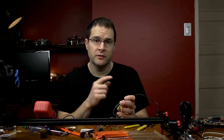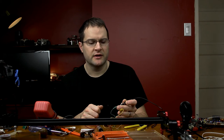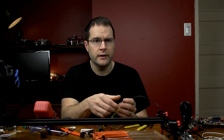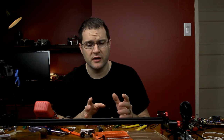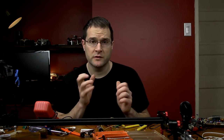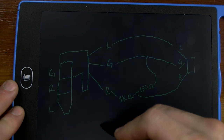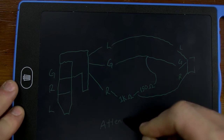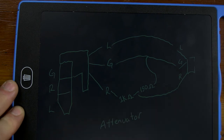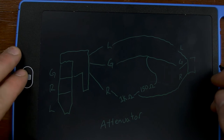So I have one mono jack and one stereo jack, all going through the attenuator, all coming out to another male stereo jack that you can plug right into the camera — we should be good to go with a safety track. It's actually pretty straightforward, pretty easy. This should give you about negative 18 to negative 20 on the right channel, and then your left channel is going to be whatever you set the input of the microphone at — pretty much normal. Left normal, right attenuated.